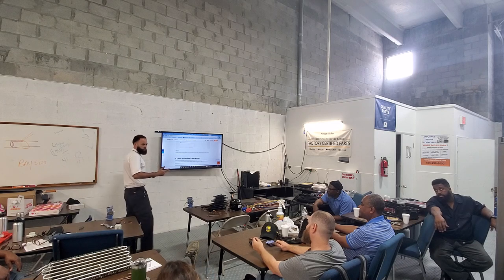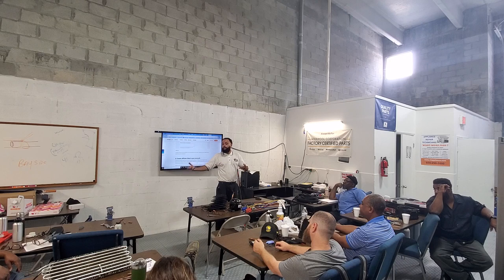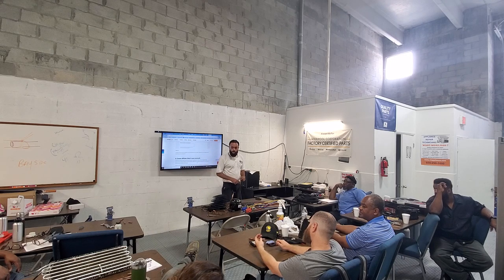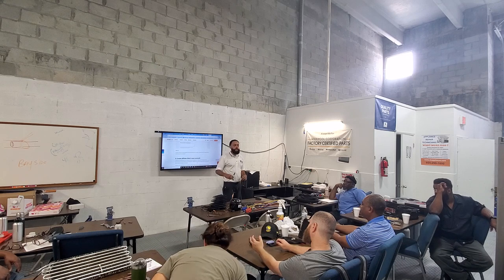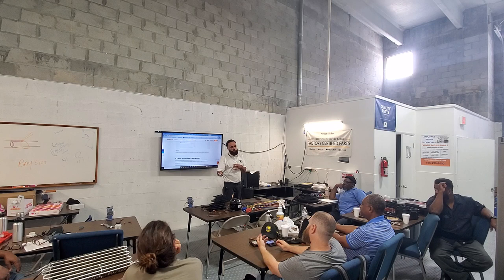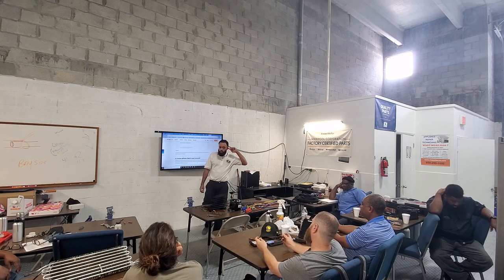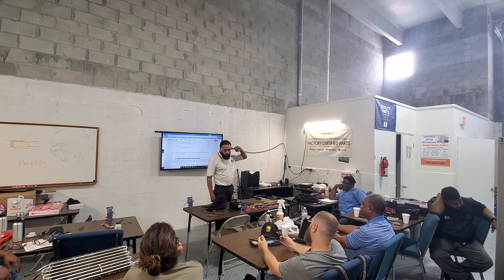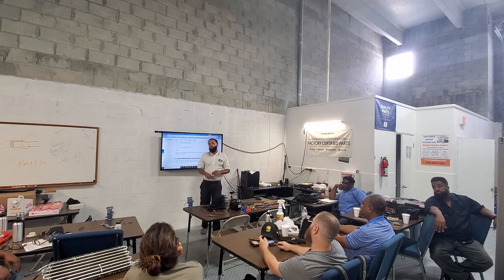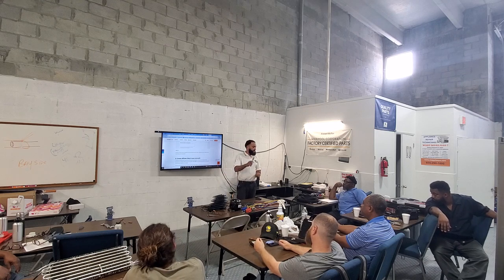What is the difference between the two? One has a chime, one doesn't. In electrical terms, one's giving you continuity, one's giving you the actual response. Tell me the difference between those two words. What is continuity and what is resistance? Continuity would be to check an electrical path between one point and the other, versus ohms would be checking the resistance of a load. Correct. Did everybody hear that?